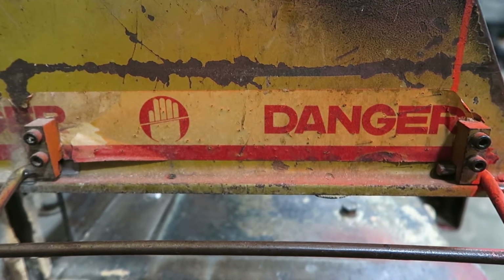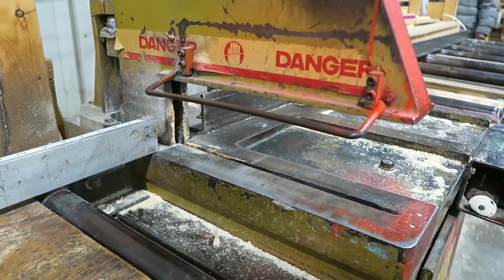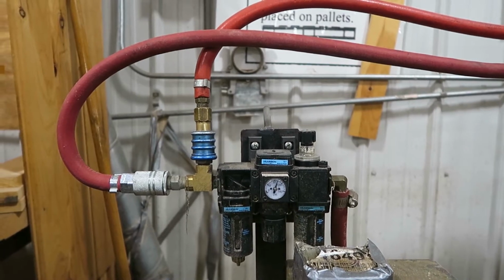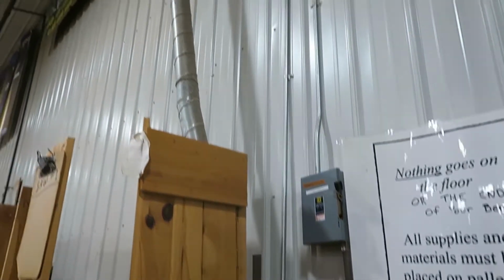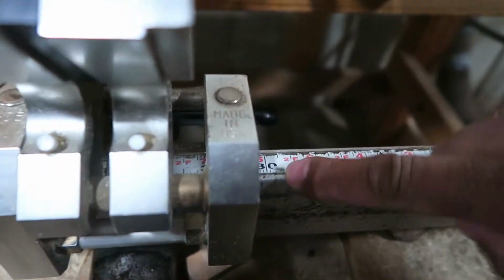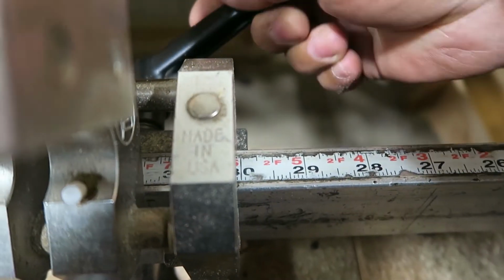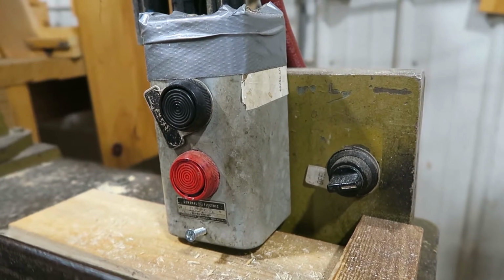Before operating the saw, understand where not to place your hands in the machine's danger zones. Make sure there is pressure in the hydraulic system and that the dust collection is turned on and operating correctly. Adjust the guard to the correct length and perform a test cut to make sure it's correct before proceeding. You are now ready to turn on the upcut and begin the job.